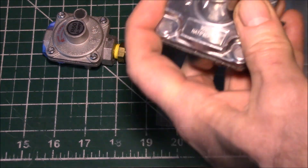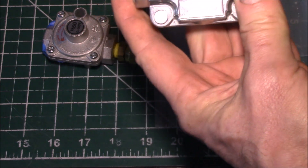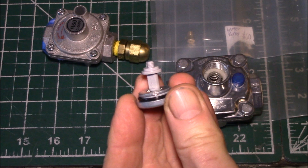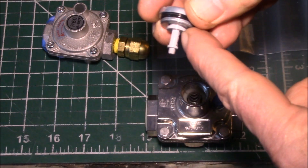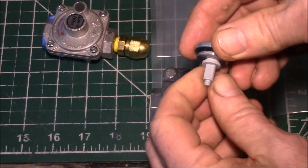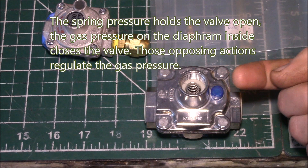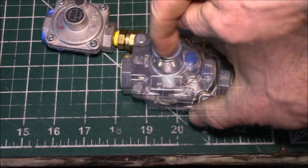This was the original propane-only regulator, fixed at 10 inches water column. You can pop this top cover off — there's a screwed-on cap — and there's a plunger inside. You just take this plunger and that's the natural gas position. If you reverse the plunger it's set up for 10 inches water column and propane. In the natural gas position it doesn't push the spring down very far, but switching it around puts more force on the spring, which means it takes more pressure in the gas to push the valve, giving you higher pressure.